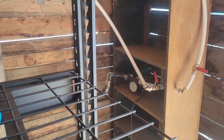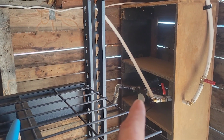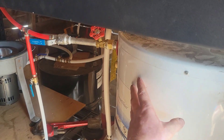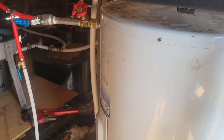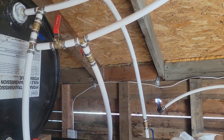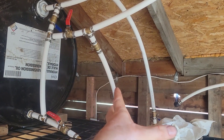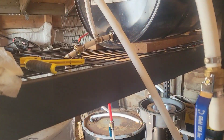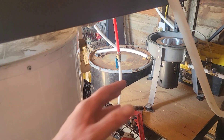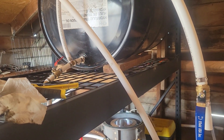The pump shut itself off — it wasn't even able to suck out of a whole 55-gallon drum. Super loud. Very unimpressed with this pump. So I've had these valves on for quite a while trying to get this water heater to fill up, and it's just not working out. I thought maybe I had a vapor lock on my vent line, so I went ahead and cut it. That gave me a little bit of suction but not a lot. I'm going to have to figure out a place to put my vent tube so that if it overflows it's not going all over the ground. I honestly thought that gravity would just fill it and push the air out through that other line, but that's not working. It's honestly starting to become pretty frustrating getting this all to work.